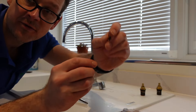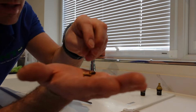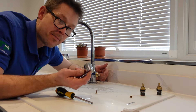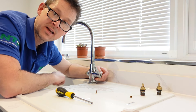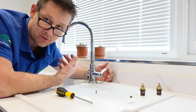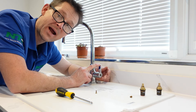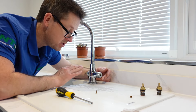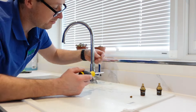Once nipped up, you might find the old screw is a slightly different diameter to the new screw — if so, just take the old one out and put the new one in. Now align the tap head onto the top: if it won't go any further down and it doesn't look right, that's the off position, and the other way is the on position. Push it as far back as it'll go, take it off, and put it back on so it's vertical — that's the off position. All the way down is the on position, perfectly straight and level. Then get your screw and screw it in.